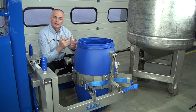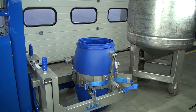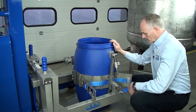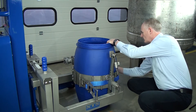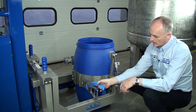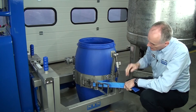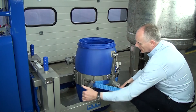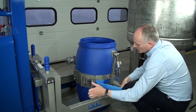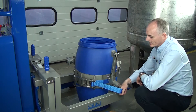So what I'll do now, I'll come round the other side and we'll tension it up. Next thing we do, take the ratchet strap off here, reach around and fasten it on the door. Then we grab hold of this strap here and we pull this - so as we pull this, there's no gap in the band all the way round. Keep this in your right hand and then we tension it. We only tension it until the drum starts to deflect and then that's fine.